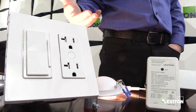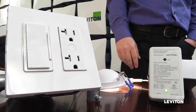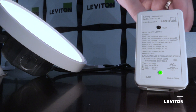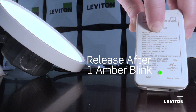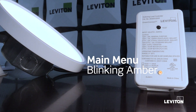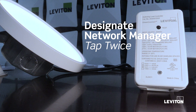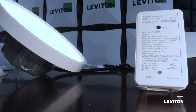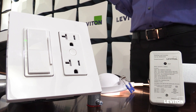The installing contractor gets to decide if they want to use the wall box device or the junction box load controller as the network manager. To create a network is the same process: come to my test button, press and hold. First I'll see device status, and after one amber blink I release — now I'm in my main menu. I tap twice to tell the junction box load controller that it's going to be my network manager. It resets itself and when it comes back online, it's now configured as a network manager and will open the GreenConnect network.